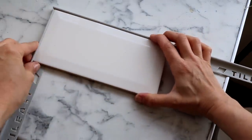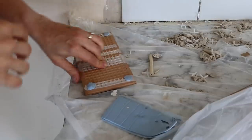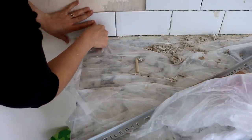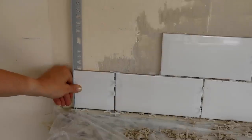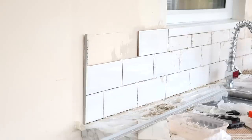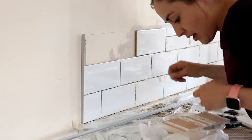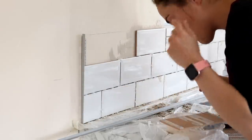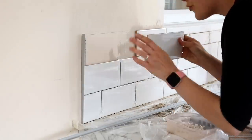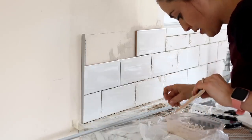I think this is pretty neat, but the trickiest part of this job was working out where to cut the depth of my trim. Because I only had three rows, I found the blue tack hack did a perfect job — though obviously you've got to be careful in case they fall off, or you could lay a pattern on the floor with some spacers and measure it that way instead. This is also when I realised that by having my tiles centred for the sink, I couldn't have my splashback right to the very end, but for the sake of 8mm I think it'll just blend in by the time I've put silicone around it. So I'm temporarily blue tacking just this small section so I can make sure I get the trim exactly right. It's tricky doing this on your own — if I cut it too short it's going to really annoy me, so it's worth taking the time.